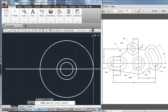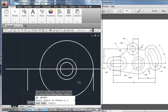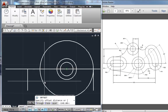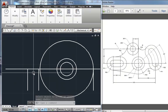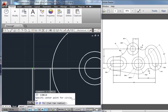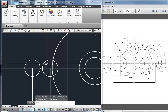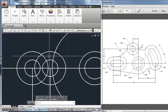I'm going to drop a line from here straight down and offset 148 millimeters — pick that line, click to the left. This is that 148-millimeter line. Now I need to come back 25, so I'll offset 25 and click over to that side. Let's start with the nose here. I have an R22 and R11 to form this double slot shape. So I'm going to do a circle from here at a radius of 11, do the same circle here hitting enter to get the same size, then a circle from here at a radius of 22, and one more circle hitting enter for the same size.